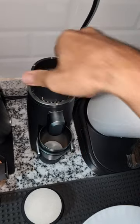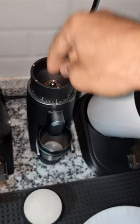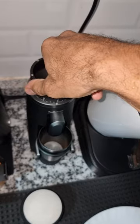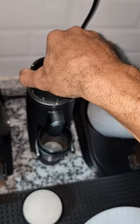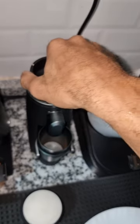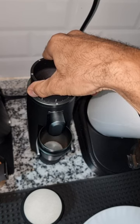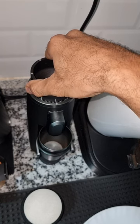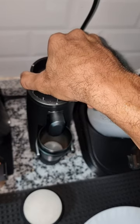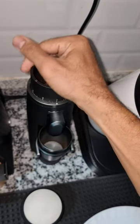Number one is just the starting point. From one rotation until you reach number 10, that is one millimeter, which is 1000 microns. From 1 to 2 is 100 microns, and there are 10 steps between every number and the next, so each step is 10 microns. It's very very precise.